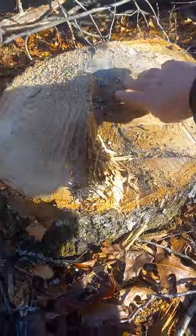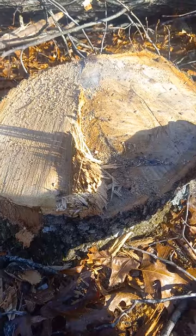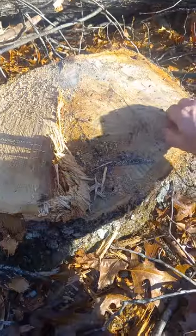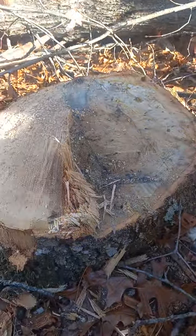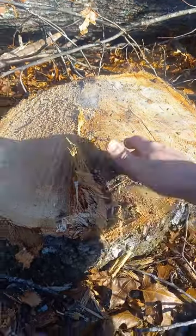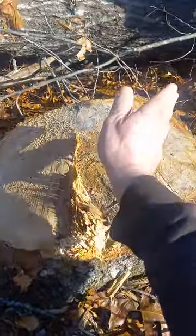Then you're just coming around, popping your wedge in a little more - is the tree working with me? Is it gonna go my way? You want feedback from your tree. You don't want to cut all this wood off before the tree has said 'yeah, I like your plan.' If you put in one wedge and you're hammering on it, the next one should go in kind of easy. If it sounds rock hard like you're banging on a concrete block, that tree ain't gonna go the way you want. If you just keep cutting, you're gonna lose the tree.